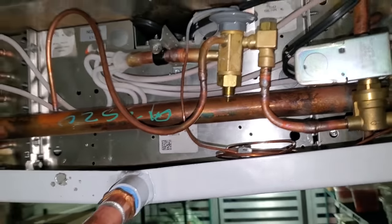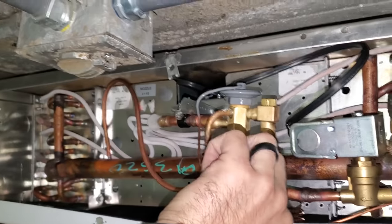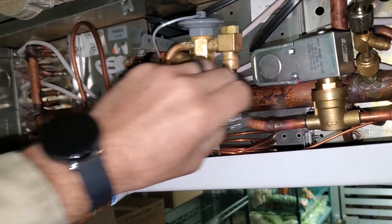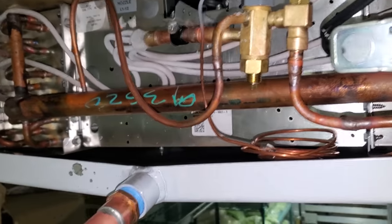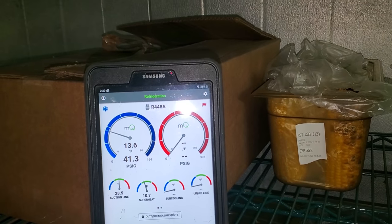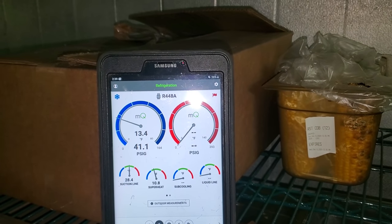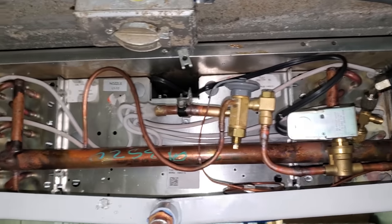To make the adjustments, I'm just going to pop up in here. I pulled the stem off and we're going to back it out a little bit, see if we can get it to calm down. So we're going to do 1, 2, 3, 4, 5, 6, 7, 8, 9, 10 — 10 quarter turns and see what that does. We're going to let it sit for about 10 minutes and let it stabilize out. Looking really good now. We're at about 10.7 degrees superheat, and it's still kind of stabilizing out. I'm liking that number. We're probably going to go outside and finish checking everything out there, check the condenser TD and all that good stuff.